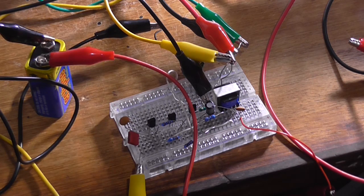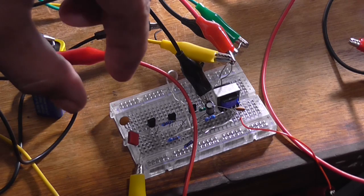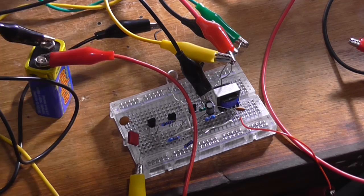These transistors are annoying me because I always remember that the Fairchild BC range was always emitter on the left, not collector — apparently now it is collector on the left. What I need is one of those little plug-in LCR meters where you plug the transistor in and it tells you what pin is what. I don't have one or access to one, but considering that when I reverse the transistors it sounds distorted as heck, it tells me the pinouts are wrong. It's the other way around. Anyhow, I just thought I'd reinvestigate this little IC that was on the project kit.